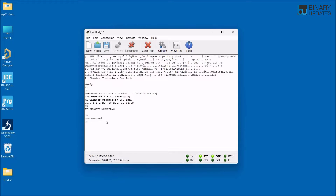Mode 3 is both access point and station mode together. Hit Enter and it returns OK, meaning everything is working fine. To scan all Wi-Fi networks around you using the ESP01 module, type AT+CWLAP and hit Enter. It will scan and show results — for example, 'binary updates' appears as an access point with its MAC address.